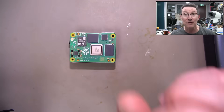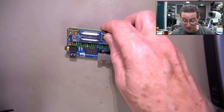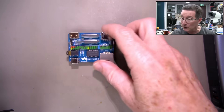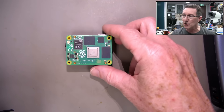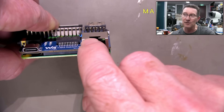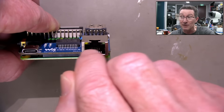It had failed, and there's nothing wrong with the actual gateway itself — I believe there's a problem with the compute module. I've got a second one of these modules and it works fine on this adapter board. I can hook up an HDMI monitor and get the penguin-y boot sequence and all the rest of it. But when troubleshooting this one, I was getting nothing out of it, and even with nothing plugged into Ethernet, both Ethernet LEDs were on and dim, at like quarter brightness.